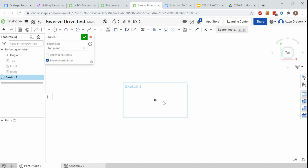What I want to do now is I want to have four. Basically, I'm going to draw rectangles because we're going to use the feature scripts to generate our rectangle tubes for us. So we're going to make 1x1 tubes that act like either VersaFrame, which is stuff you can get from Vex that already has holes in it, or maybe we took a regular 1x1 and drilled our own holes into it. But we're going to use the feature scripts to do all of that for us. So we're not sitting there having to CAD and sketch out every single circle and make the tubes or anything. It'll do a lot of this for us really quickly.